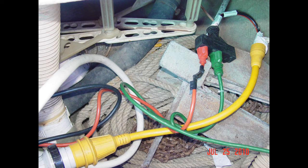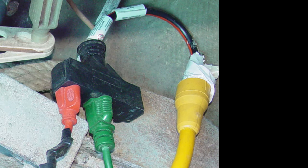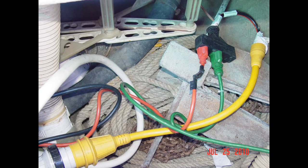So the owner of this vessel needed AC power on board, but he didn't want to fuss with any of those frilly add-ons like plugs, breaker panels, and permanent wiring. His solution was to simply take a 30-to-15-amp adapter, cut the end from a three-plug extension cord, then tape the wires to the prongs at the 15-amp adapter end. No need for that fancy electrical grade tape either. While quick and easy, this approach pretty much defies any standard or recommendation regarding AC shore power installations known to man.